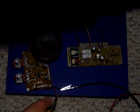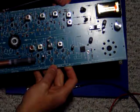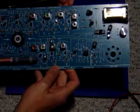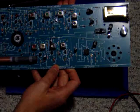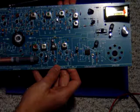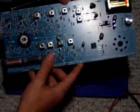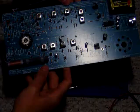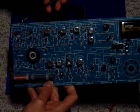And then this we built — it was just a kit, but we really went through and studied radio: frequency modulation, amplitude modulation, bandwidth — how an LC circuit, an LC tank, can select for different carrier frequencies and how the information signal is then filtered out of the carrier wave. And the difference between why an AM antenna has all these windings, which relates to the frequency of the carrier, versus FM which has a shorter antenna.